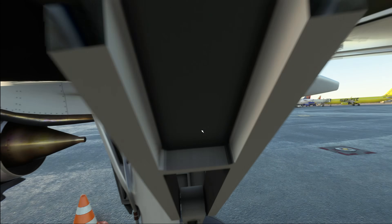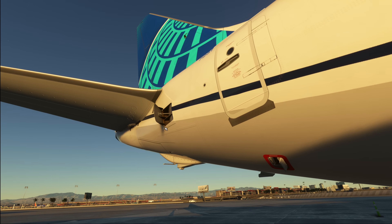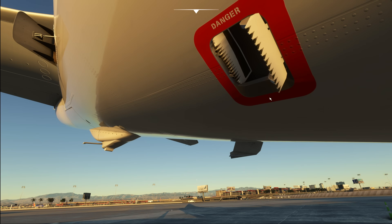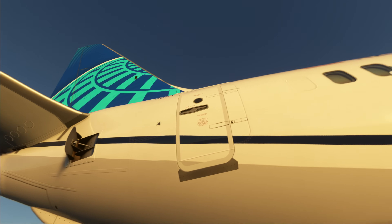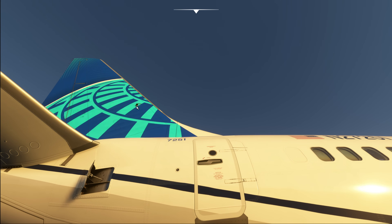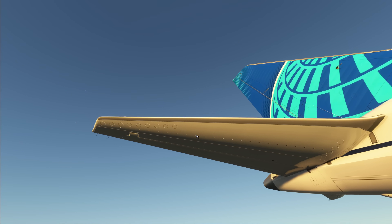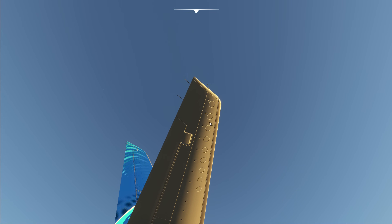With no damages found, we move on towards the back of the aircraft. Moving further back, we have the APU air inlet door — we make sure it is not obstructed, no birds, and no visible damage. The same goes for the outflow valve. On the top of the vertical stabilizer you have the elevator pitot probes, which we make sure are unobstructed and undamaged. We also check the leading edge of the vertical stabilizer and make sure the static wick dischargers are in place on the side.